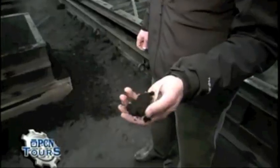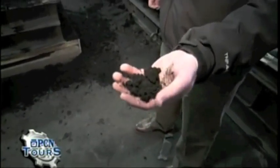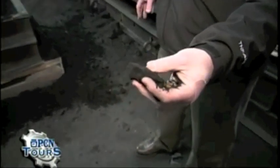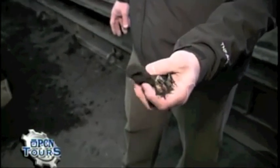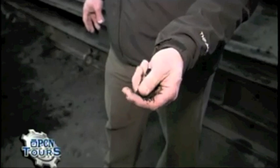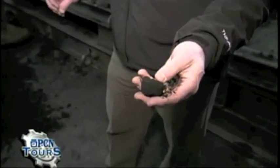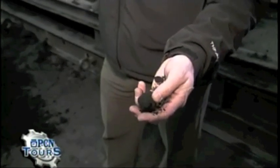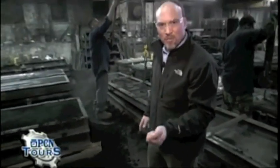I'm going to show you an example of the sand when it's compressed. It has a little moisture and some chemicals that cause it to bind — when I squeeze or compress it like Ernie was doing, it solidifies and will keep the mold solid when we pour liquid iron into these poles tonight. This sand is called olivine sand, and it's non-toxic. The sand binders and particles hold together against the volatile iron, and because we don't use silica, it's safe for workers even as the iron goes in at 2,700 degrees with no harmful fumes.